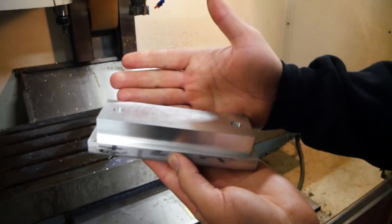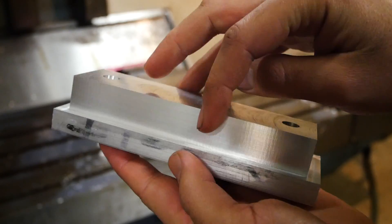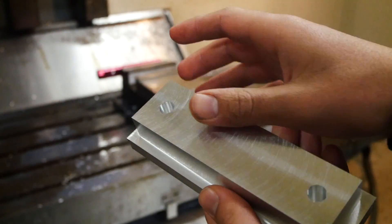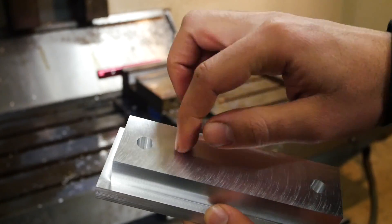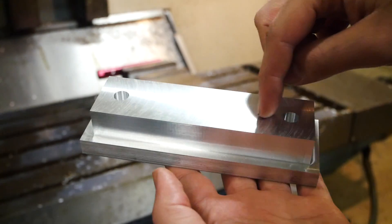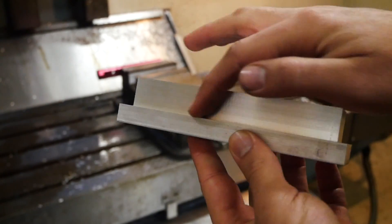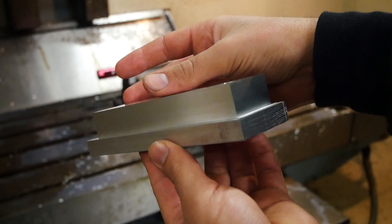Look at this thing. Look at that. The surface finish on the sides is so nice - very smooth, very nice. The one on top with the face mill is a little bit rough. It's very hard to see but it's definitely there. So what I'd like to do is change the speeds and feeds to get it smoother. This one is all good so I'm going to leave that as is. I'm stoked right now because this is nice.